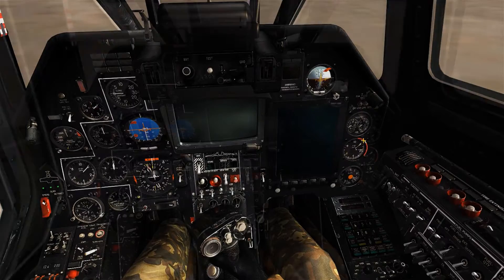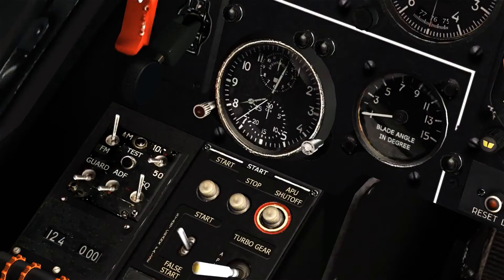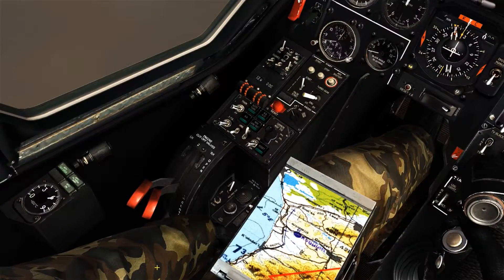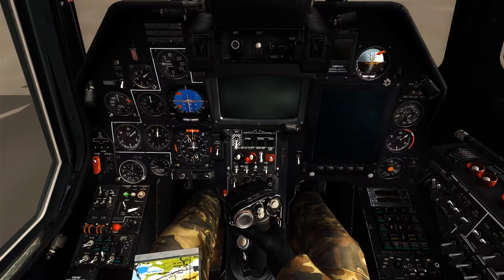At this point, you can perform another crank start if needed. In this example, I do perform two, although I only demonstrate the one, as it can take a couple of crank starts to burn out all of the excess fuel. At this point, I'll disengage the rotor brake, set the selector into normal start, and start the engine as I normally would.